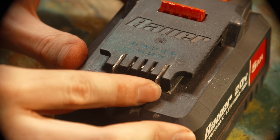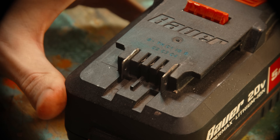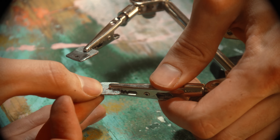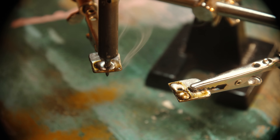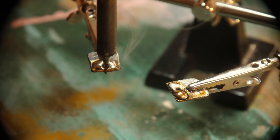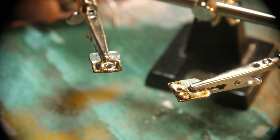You can just buy sets of these pins — I'm sure they're like a dollar — but this took no more than 20 minutes to measure and cut out, which beats shipping times. I dipped these in flux and put some solder on them before inserting them into the plastic part, so I don't accidentally melt everything when I'm trying to actually wire it up.